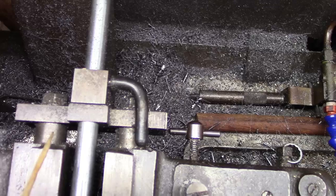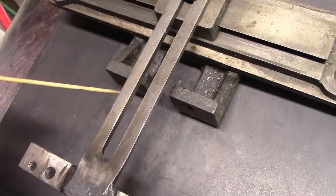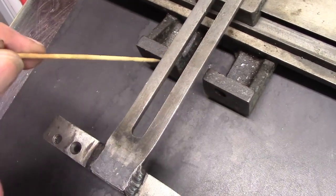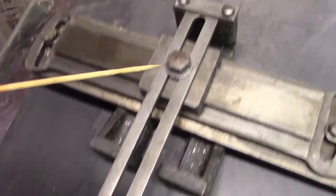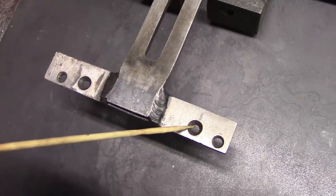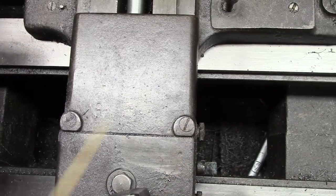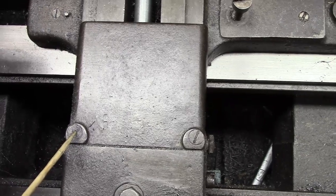A piece of bar that can slide out and lock, but this would all come off. So that casting mounts to the saddle, and then this slotted piece here goes onto the cross slide - where these two screws at the moment hold a cover plate which just keeps muck off the lead screw.